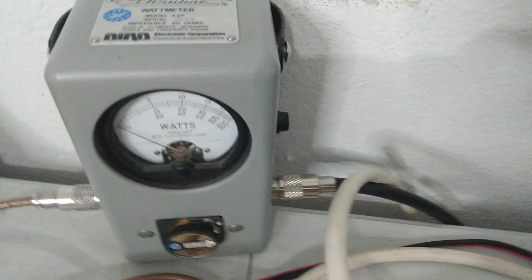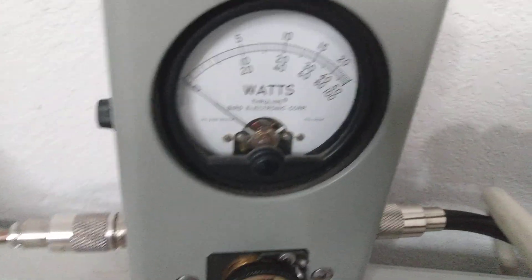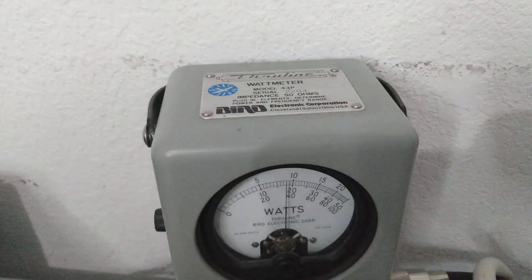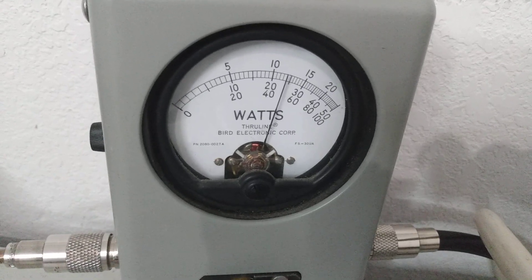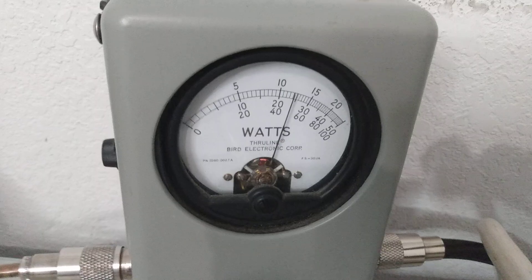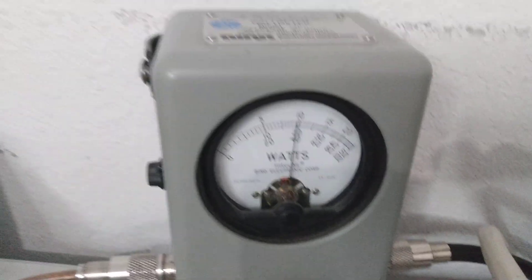Let's get into the output test. We've got our 2,500 watt slug in there — we're going to be looking at the top scale. Let's go ahead and give it a key up. We're rocking with about 250 watts dead key, maybe a little bit less. Almost 500 average, probably about 475 — we'll call that. Again, we don't have it tuned for average, we have it tuned for peak. We've just turned the peak kit on top scale — about 1,250 PEP. The amp does run on 110. It has also had a super nice brand new long heavy duty power cord installed on it. You can see it's holding power, not falling back, not acting crazy, right at 1,250 watts PEP — you could call that 1,245, but right there around 1,250.